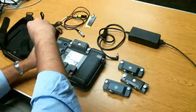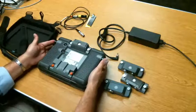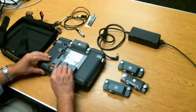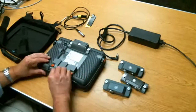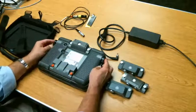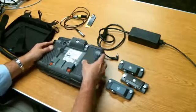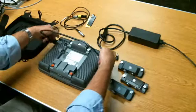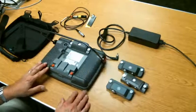One important thing to note is the kickstand, which can be used to hold the instrument at different angles for nice viewing. Do not just grab this and yank. These are not spring-loaded and are not made for friction fit — they engage positively. You must push in on the two orange buttons, one on each side, and then the kickstand will move very easily. If you force it, you can break these hubs.